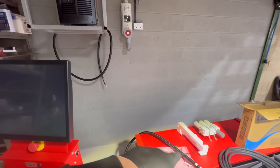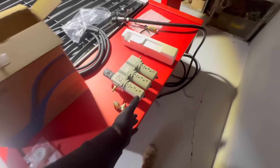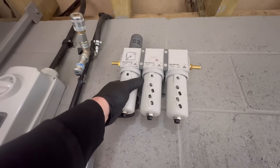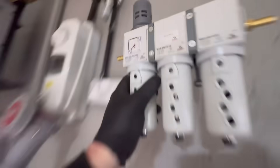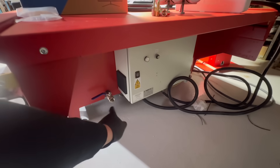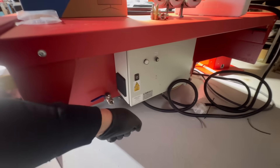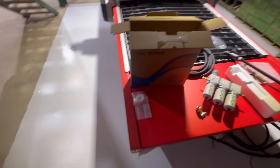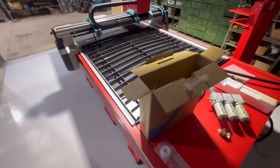There's a 63-amp power supply for the plasma cutter, and that plug will feed it. The air supply filtration system is going up there, so the pipe runs into there and then comes down the wall into the back of the plasma cutter. Under here there's the water table drain tab — we're going to put a pipe onto that and curl it under here so if we want to drain the water from the bed we can run it outside the door or into one of the drains.